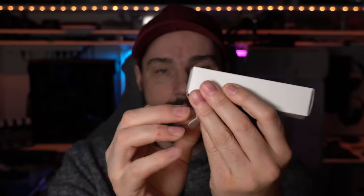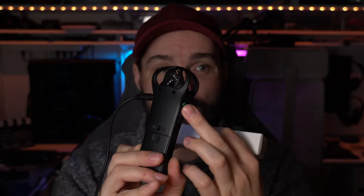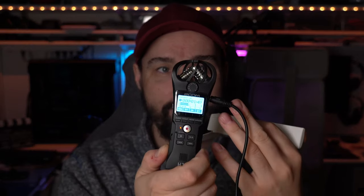I am recording into my mixer — I have a Bose mixer right down here — but the signal is only line level. I cannot attenuate it enough to get straight into my camera, so I have to go through a recording device like the Zoom H1n, which is a nice little handy recorder. But if I take the signal out of it and get it into my camera, I get a lot of noise from the preamp — a lot of white noise.